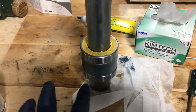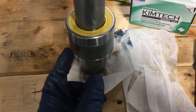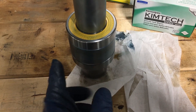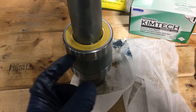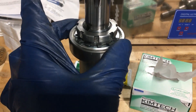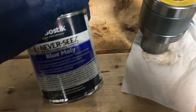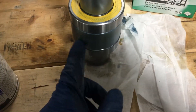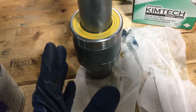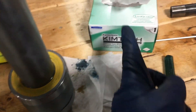We're back together. I got the two new bearings in. I put some Molykote lube on the spacers — there's an inner spacer and outer spacer: one sits on the inner race and the other on the outer race, so these are put back together properly. There's the top bearing here. I put Molykote on anything that wasn't a bearing face or bearing interface, then high pressure lube on anything that was — a very, very light coat — and after that I wiped it with Kim wipes.